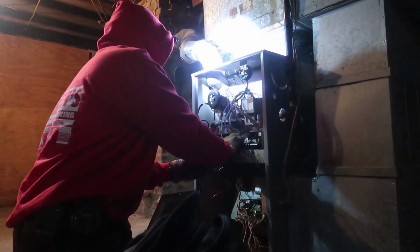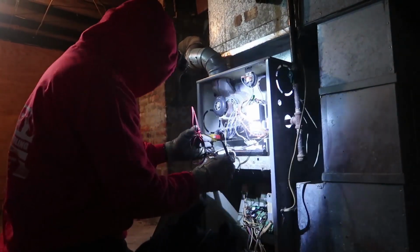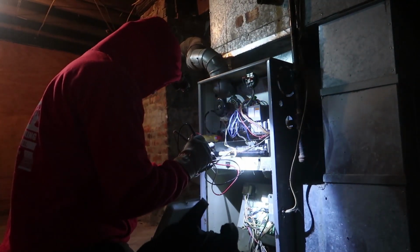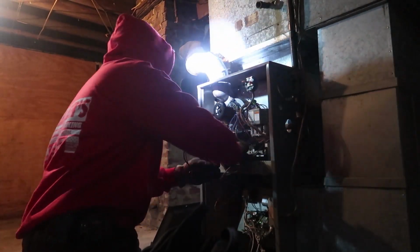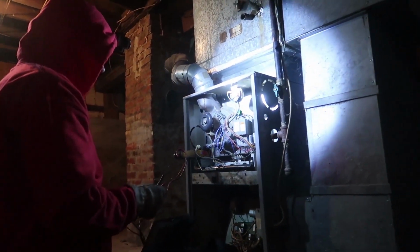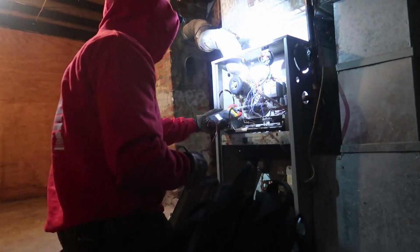They call it a smart valve, and so you don't have a control board to operate anything. It's all through there. This is a control board, but it's a fan timer control board, so it's totally different. Are they pretty interchangeable, or do they have a lot of different ones that are hard to track down? There's about 40 different gas valves that are available.